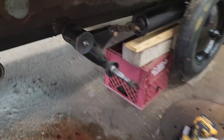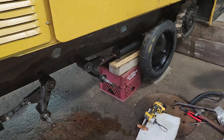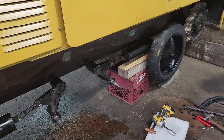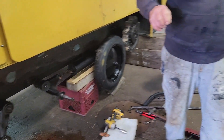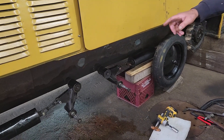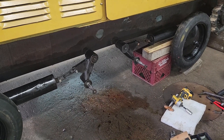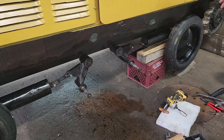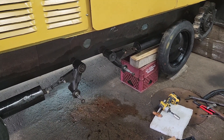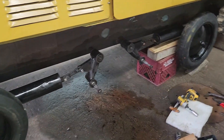What size steel do the guys need for that? That's one-eighth inch thick. If it's too thin it'll wear out. So there's new bolts on wherever needed on the bogeys. I changed a few chains because they were either too small or worn out. Once we get this far along, that's done - then we put the tracks on.